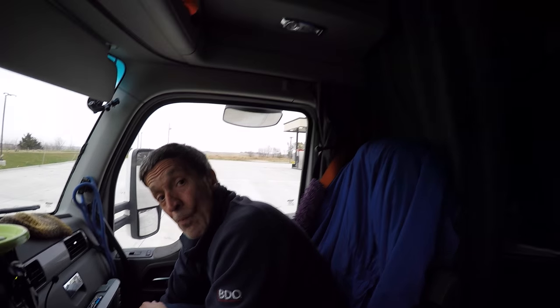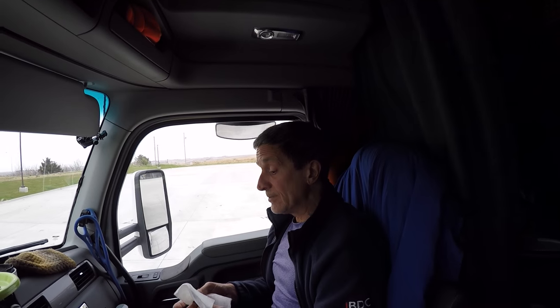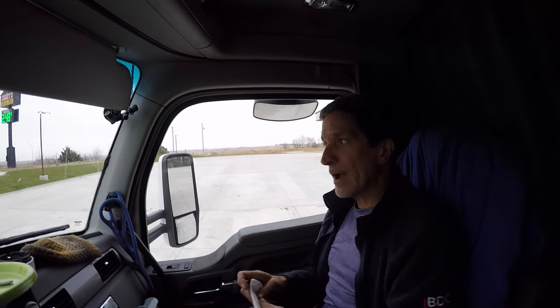Brakes. Push it back in, and they'll pop. Not always, but a lot more often than not. And then there are times you just have to rock it to break them free. Now that's different than how they teach you in school, because they teach you to pull the brake before you go back to pull the tandem. Remember the rule about school? Yeah. Forget everything you learned in CDL school.